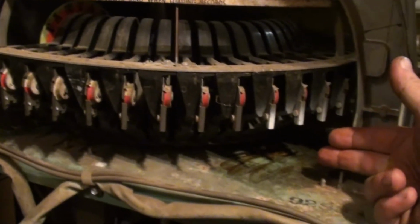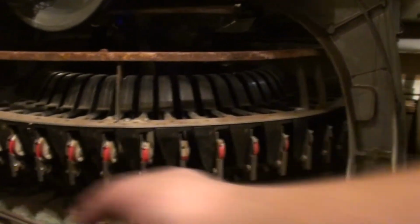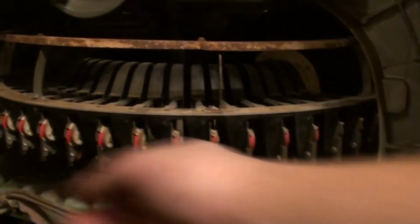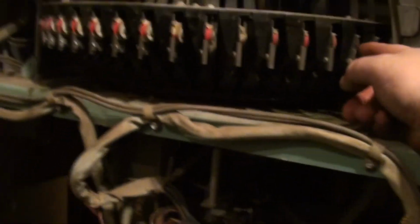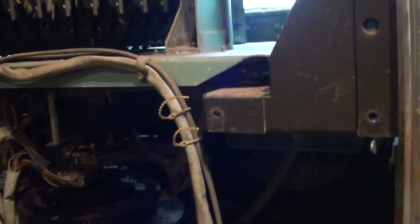But anyways, the carousel, since the backstops are now gone, and they were both seized up in locked position, this thing could not move whatsoever, but now, since they're gone, the carousel can move freely with no problems. So now, if I'm going to use any of the arms that lift the record off the carousel onto the turntable platter up here, this thing would have to be lined up perfectly by hand before it'll work. The whole thing is synced with the stuff that's down here. So, let's see. I'm not sure exactly what this thing's going to do now. I just turned the unit back on.